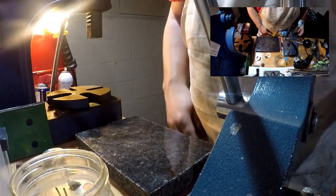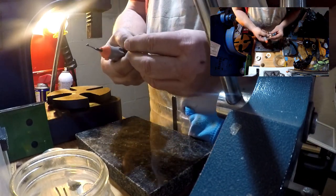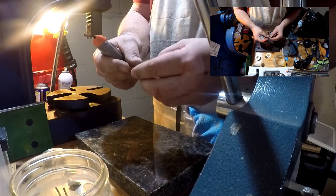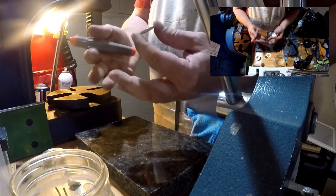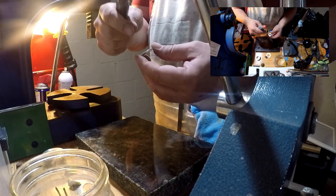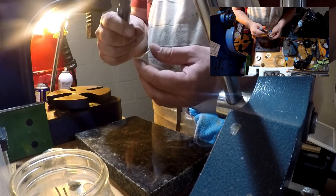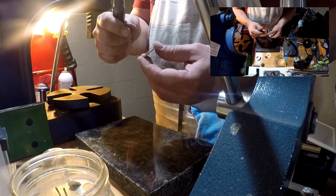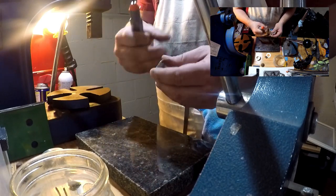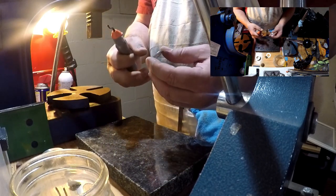The next thing I do is I deburr it. If you don't know what I mean by deburring, basically you're going to scrape out the edges, because now there's a little sharp edge in here. Two reasons to do that. A, it takes the sharp edge off. But B, the big thing is you can form microscopic tears in the coin, and those small tears will become big tears and can actually split the coin as you're going through the stretching process.